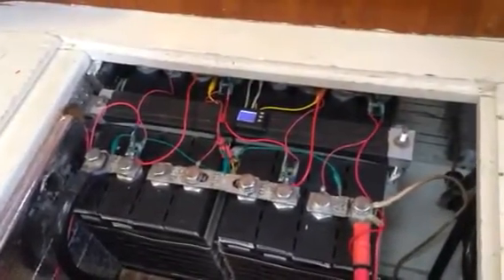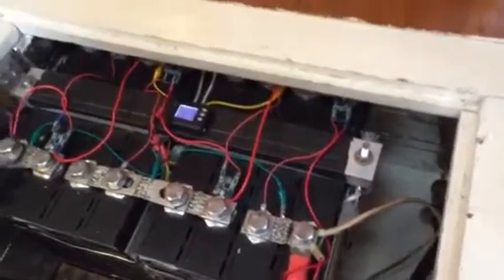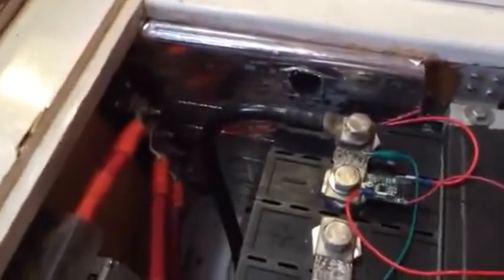Batteries are located underneath the forward starboard settee. We have 600 amp hours with Sinopoly batteries, lithium-ion, with a house BMS management system, just with a low voltage cutoff breaker. Everything is fused. The cables are 4/0 AWG, and that's the separate bus bar for the charge and for the house, and ground straps. You can see the cabling going to the inverter — same size cabling. This is voltage being read on a cell level.